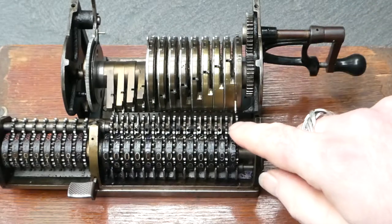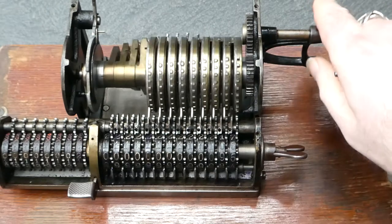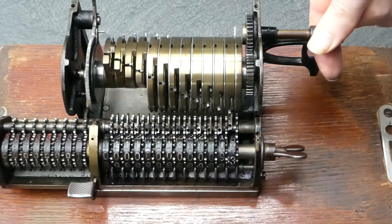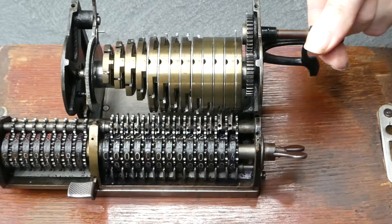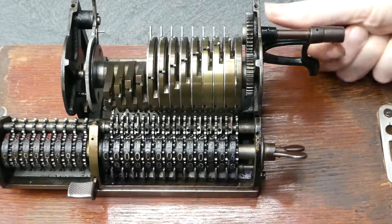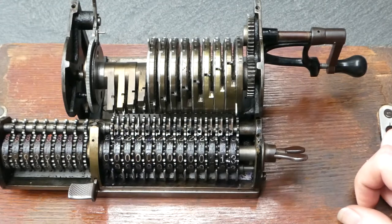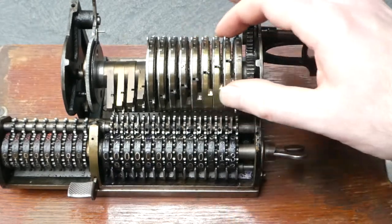One more, because next time you'll see a double carry — a carry going through two digits. Because here the first carry is performed, and now that pushes the next carry switch out. So there you go. That's the very basics of the register and the pinwheel mechanism.